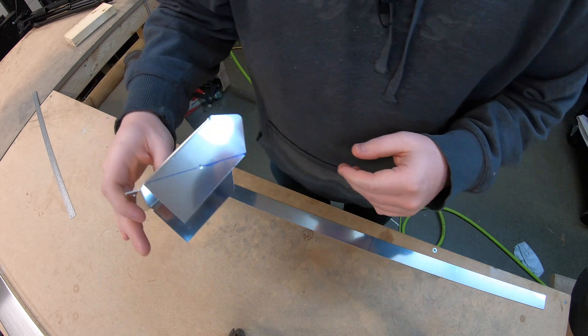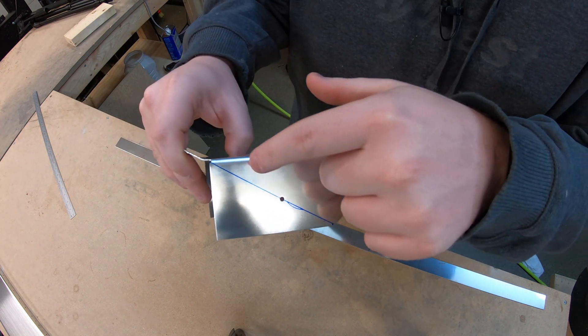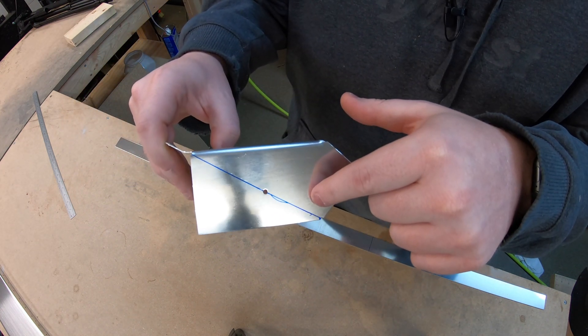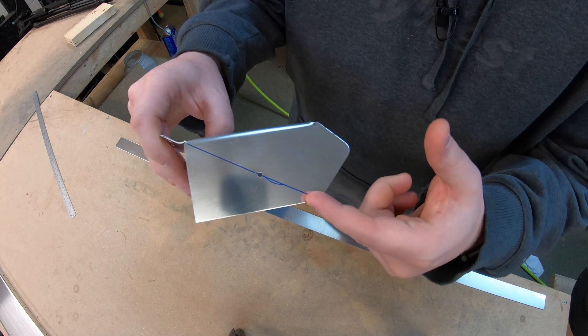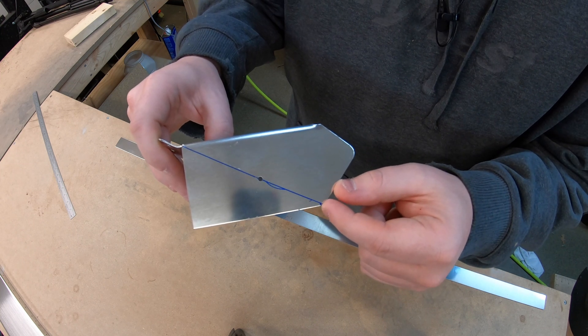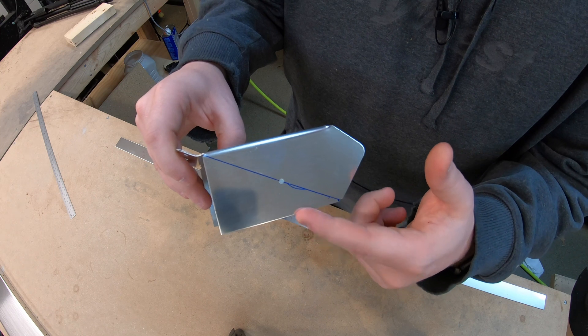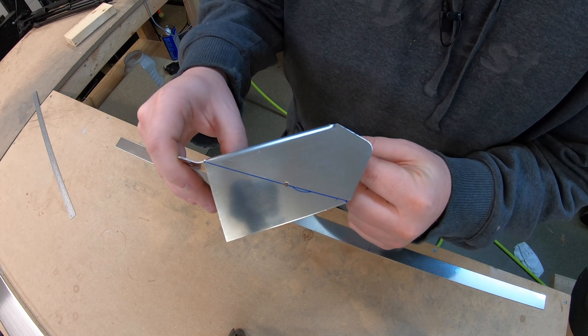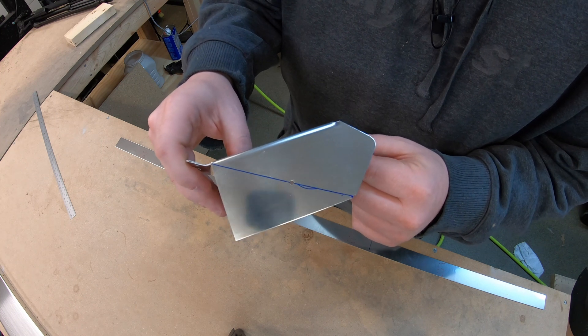From looking at the forums, it sounds like we're going to be doing some match drilling, some rivet holes along the skin here, just on this side of that line. So we want to make sure that we don't trim this edge too tight — we want to make sure that we have that minimum spacing that we're going to need for those rivets. So I'm going to cut it just a little bit on the scrap side of the line and then we can always trim it in as necessary once we know exactly where those rivets are going to line up.